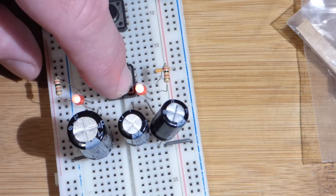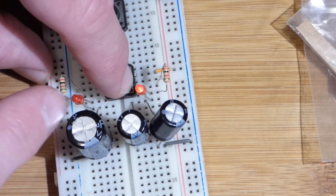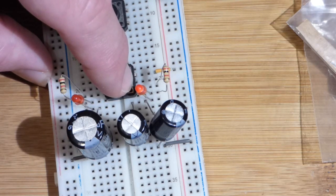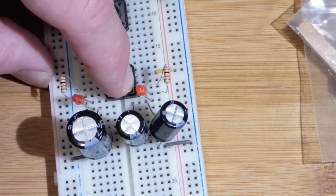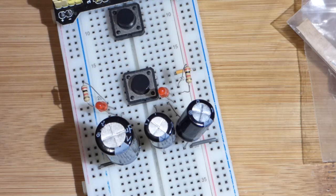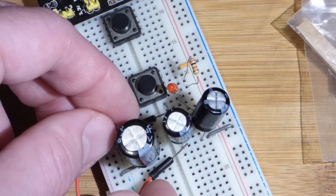You can see that both LEDs turned on, but they're two separate circuits, starting right where the resistors connect to the switch, because that's all one conductive area. You can see the single capacitor — the LED went out about twice as fast as the two other ones. They're equal values, and these two are both storing a charge, so it's going to take twice as long to charge and twice as long to get up to the power source voltage minus the voltage drop of the LEDs.